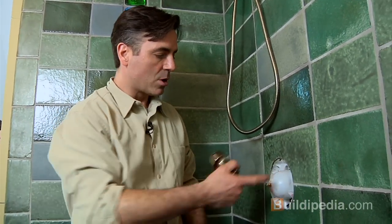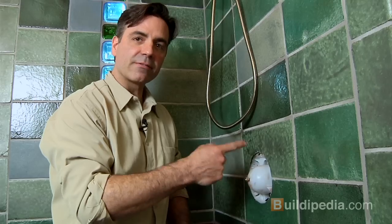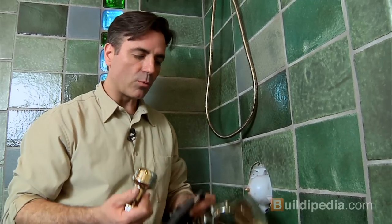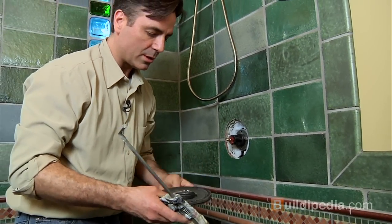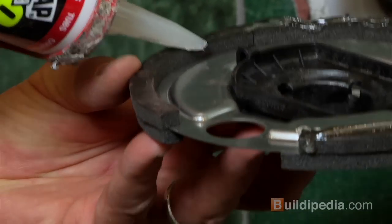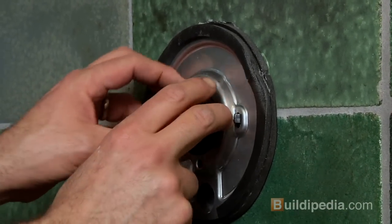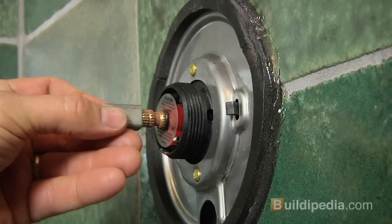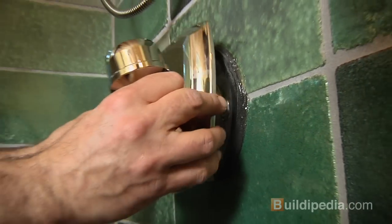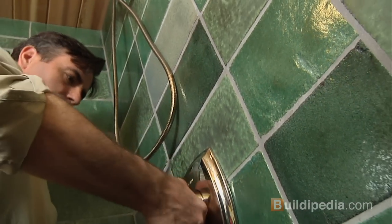Last step is to install the trim over the valve. When the valve was installed, it was installed with plastic pieces that protected the valve from all the finish work, whether it's tile, sheet rock, or whatever. That plastic part will come out and we'll install the finished pieces. According to the manufacturer's directions, they want a bead of silicone on this part of the gasket — even though there's a foam gasket there, it slides on. I install the backing plate with two long screws and touch up the sealant around the gasket. Next, I'll install the stem adapter on the end of the valve and slide on the face plate. Finally, fit the handle onto the threads and hand tighten — this will securely hold the face plate to the wall.